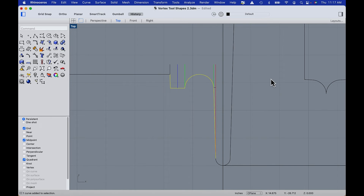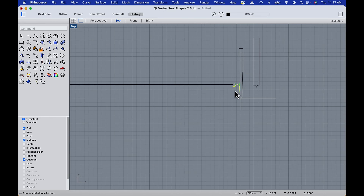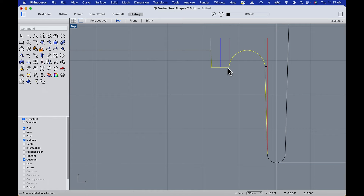Now let's take a look at this in Rhino — this will show you how the shapes actually came out. This is the beaded edge. This tool right here is the 2215 — we've already done that, so we've created the toolpath that creates that edge. Now we're going to take this Vortex bit and create this bead. The center lines here and here — with those two toolpaths, that creates the bead. This is down from the surface about 10 thousandths. Then we come around here, and that bead comes over here also, so we have to create some clearance. This flat is an eighth of an inch — that's the center line of an eighth-inch tool. And then we're doing the same type of setup as earlier with the 3D engraved path, except this is a 30-degree bit to give us that square corner. We put all that together and we get the bead. These are actually offsets, and these offsets tell me where to put the center of the toolpath so that when we're done, we get this shape.